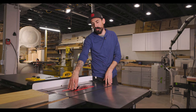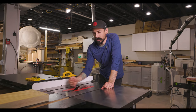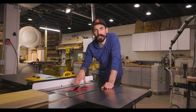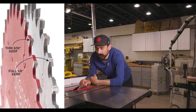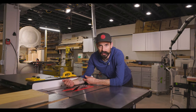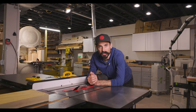A few other circumstances where someone might remove a riving knife: if you're cutting dados, you obviously cannot have a riving knife in there. Using a crosscut sled is another example. Some flooring guys use table saws for drop cuts in the center of a board — I wouldn't recommend it, but they do. Lastly, if you're changing to a thin-kerf blade and the riving knife is now thicker than that blade, it actually becomes more dangerous to have it in. Always make sure your blade is slightly thicker than your riving knife.